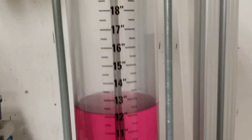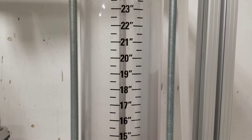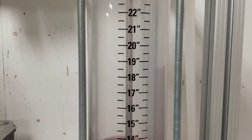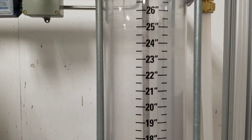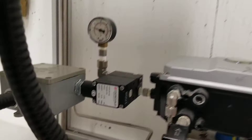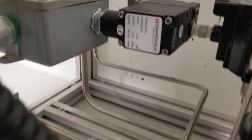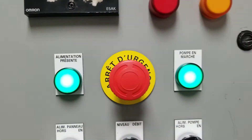One thing I want to tell you is the more liquid you have, the more pressure you have, and the easier that the liquid flows through the drain. So your magic number at the top may be higher than your magic number at the bottom for your pneumatic valve. So I'm going to leave that valve at about 50% and leave this magic number at 30%.